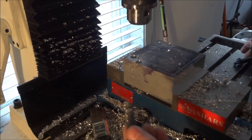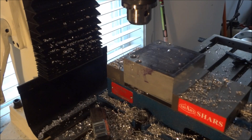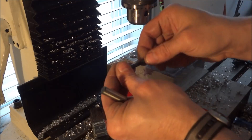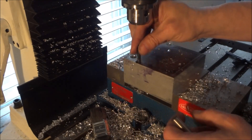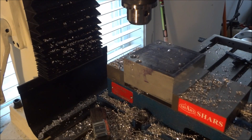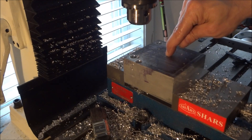I had to come back with a different boring bar on these two holes, but luckily I got one that was big enough for my head to go in so I don't have to turn these down, and it didn't poke out the side, so I'm really pleased with that. Next we're going to start working on our bearing pocket.